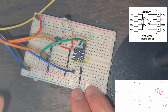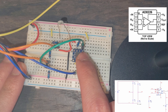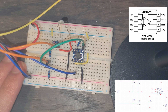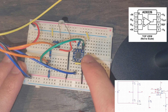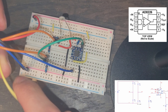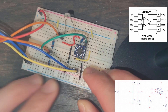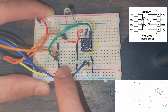We want to send a DC source into our instrumentation amplifier. We'll use the scope channel and put it into our reference, which is pin 6. We're fully using this side of the chip now — power, ground, output, and reference. We take the yellow wire without a stripe and plug it right next to our blue one for pin 6.